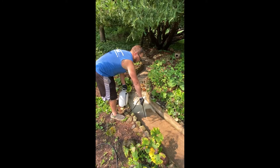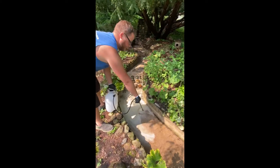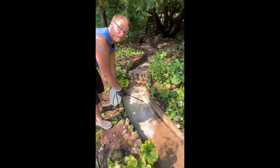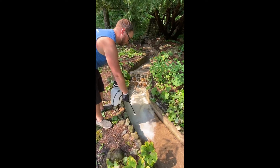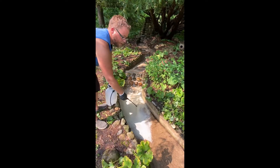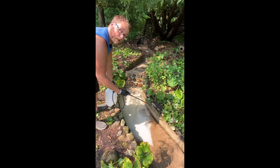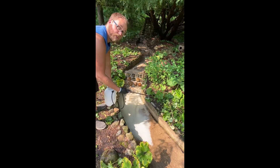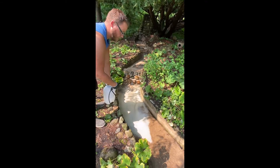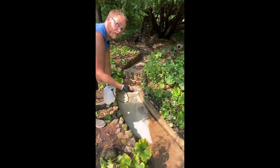Paul, why don't you tell us a little bit about what you're doing. What we've got going on here is, like Mike was saying, we've got to get this whole area surface prepped and I'm using a muriatic acid solution of one part acid to four parts water. What that's doing — you can see all this foam in here — is eating up all the calcium deposits that are within the concrete. When those are lifted out it really gives the epoxy sealer that we're going to use a lot more tooth to be able to stick and adhere to. If you were to skip this step of the preparation, within a year that epoxy could just pop right out.